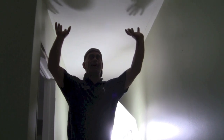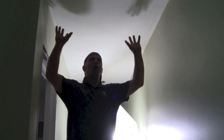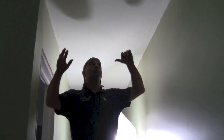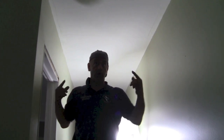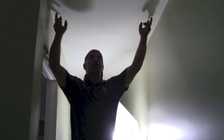I determined where I want to put this. The fan is going to be up in the attic, but we'll have a big white grill going up in the ceiling with big louvers on it — it looks okay, but we just don't want it to be seen that much. Really determine where you can put it in your attic. These fans are normally big, and the one we got for this house is the biggest I could really get. It's bigger than our ceiling joists that are running, so we're going to have to cut one out of the way. It's not a big deal because it's acting as a ceiling joist where we're cutting the sheetrock out.